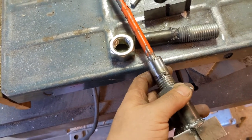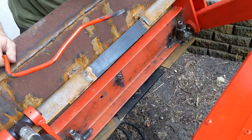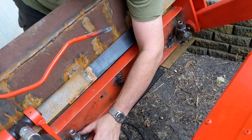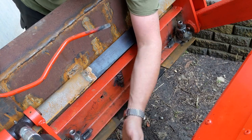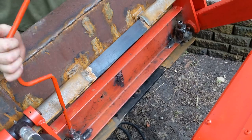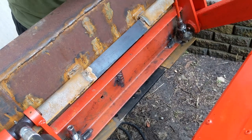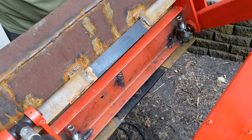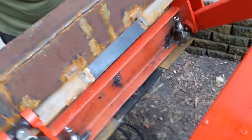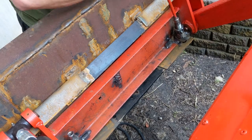Here they are welded in place. I just slipped it down so the shaft protrudes down through this hole, held it in place and tacked it, then went back and stiffened it up. To remove the bucket, stick your tool in there, unscrew about that far on the left, unscrew about that far on the right — these are not greased yet but soon will be — and then the bucket can release. To lock it back down, of course you just go the other direction.